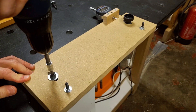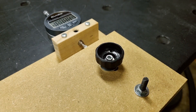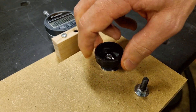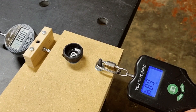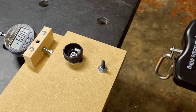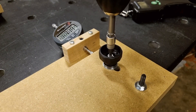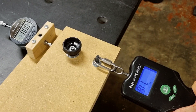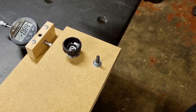I tighten the screw on the other side with the same torque, simulating a fence locked in two positions. The torque used is just below my manual grip strength — close enough to be realistic, and low enough that I can loosen the knob between tests. The first MDF test is with a standard washer. I do that test a number of times to get an average value — around 9.5 kg. Then I change to the axial bearing instead, and this time it could test my arm strength. The reading comes in at around 19.5 kg.